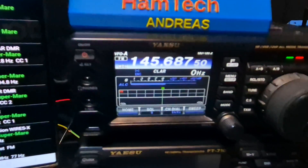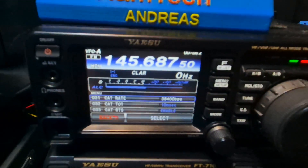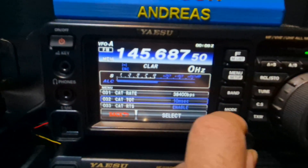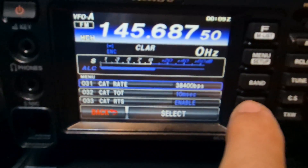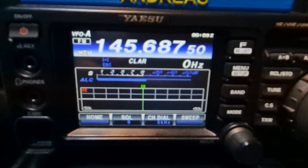In your radio, just set the menu 31. If you just go menu up and down to get to 31, then you can press select and you can change it. You want 38400 BPS. Enter, then just back out. Like so. That's all you do on the radio.